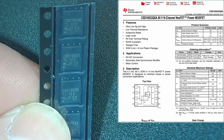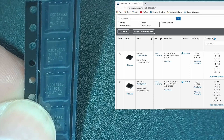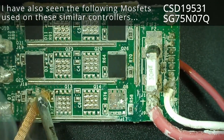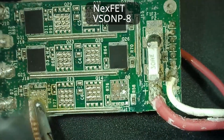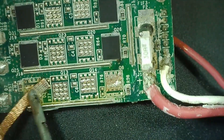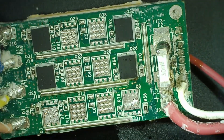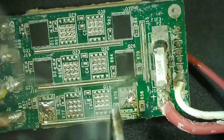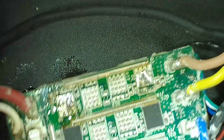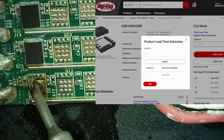We're definitely going to replace both of these, and this is the only replacement I could find in stock: the CSD18533, which is a 60-volt rated 100-amp MOSFET, instead of the 100-volt 100-amp, 80-volt 80-amp, or 75-volt 80-amp versions I've seen on controllers before. EGO uses a lot of different MOSFETs of this NEXFET VSONP8 type. I'd rather use the 100-volt 100-amp, but they're just not available — I had to go all the way down to the 60-volt version and there were only six in stock. If you can find 75-, 80-, or 100-volt versions, that's a no-brainer. I've waited about two months for this repair and hopefully after posting this video more will become available, as DigiKey showed some expected in stock in a couple of months.